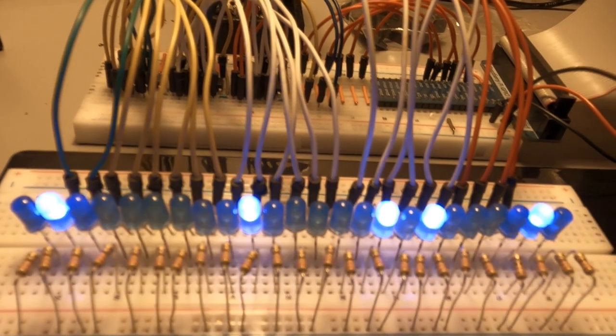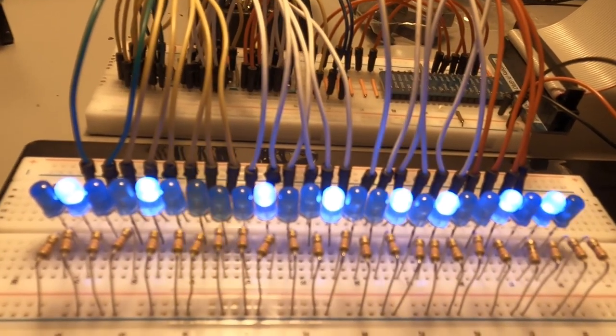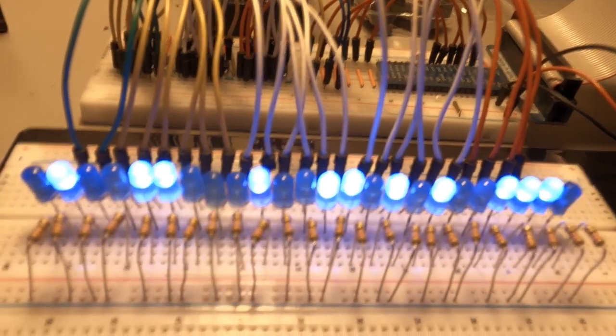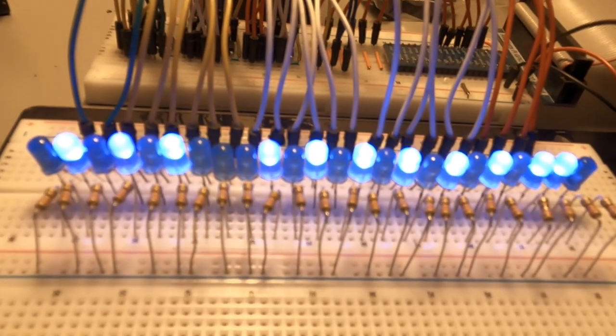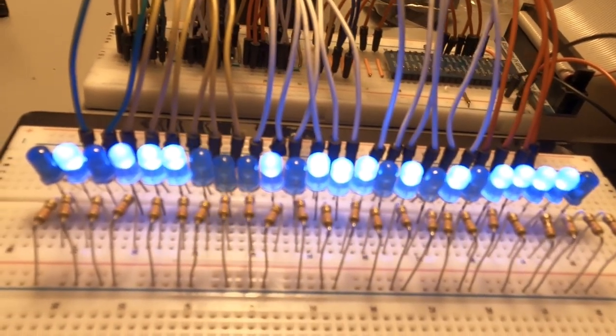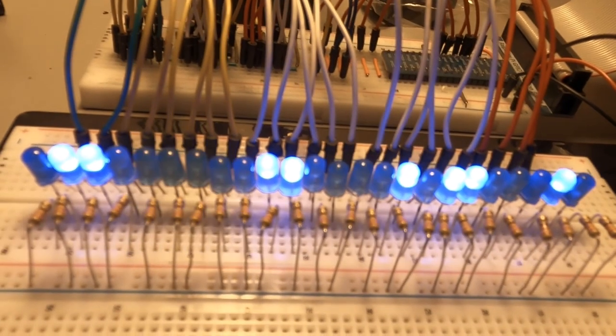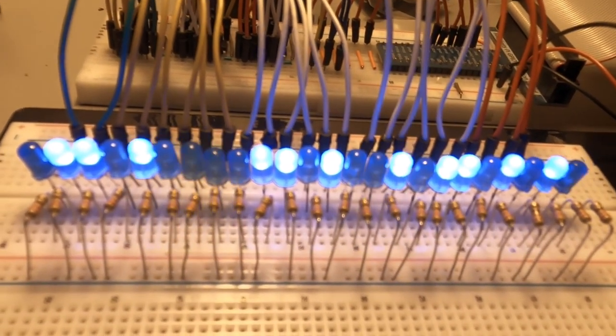But this lets you know that these shift registers are actually not really independent of each other. If you're going to do something that's 8 bits, you've got to unhook the two other shift registers from the leads. That way you can actually get only one to work if you want. But that's what it kind of looks like.